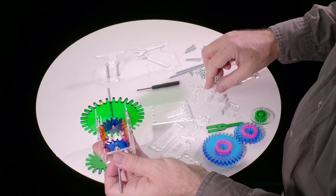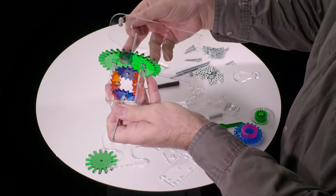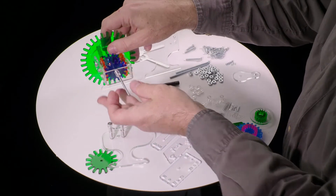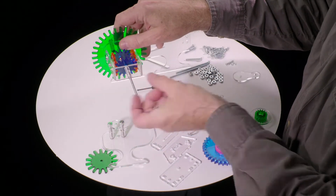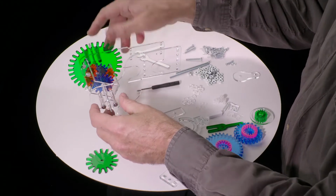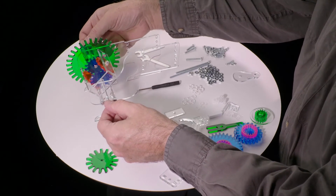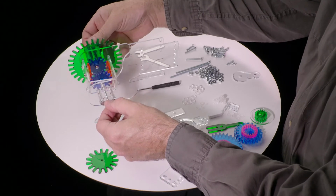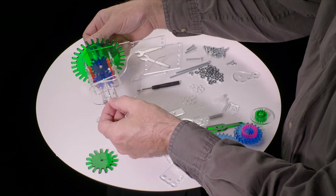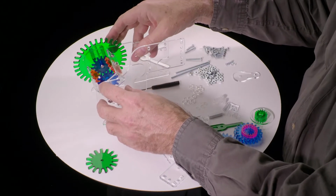So we take a 9mm washer, second thickest, slip it on there, and then slide this through both of those holes. And then, kind of holding this all together, we take another 9mm washer, slip it through there, and that through there. Now this, it's very wobbly, but it will sort of hold up. If these gears don't spin very easily when it's kind of held square and in the opposite direction, I'm pulling out on the gears also to keep them in the right position. If it's not spinning very easily, it's probably because the teeth are off by 1, and you may need to take it apart and fix that because it won't work right.